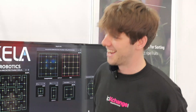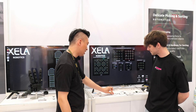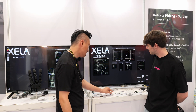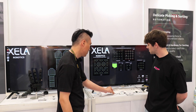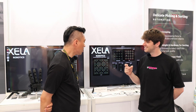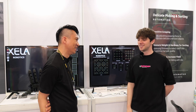What is a taxel? So a taxel is one unit of a touch sensor, as you can see here. In our case, our touch sensor uses a magnet — you can see one magnet here — and we can sense force in three axes: X, Y, and Z. So this is tri-axial force sensing. I'm not really sure what the origin of the name is, but that's what we use.